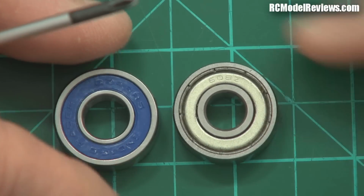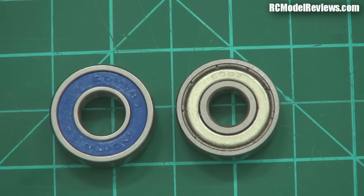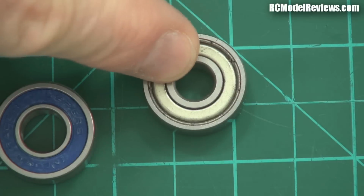Another thing to remember is that these are usually packed with grease. And grease, as you know, is quite viscous. It's like a cream. You can put your finger in it and it'll come out on your finger, whereas oil is very runny. Where you get high speed, you want something that's really runny. Imagine, if you run through the air, you hardly feel it. Try running through water in a swimming pool, you can hardly move. This is like trying to run through a swimming pool, this is like trying to run in the air.